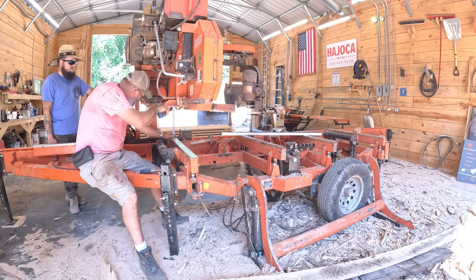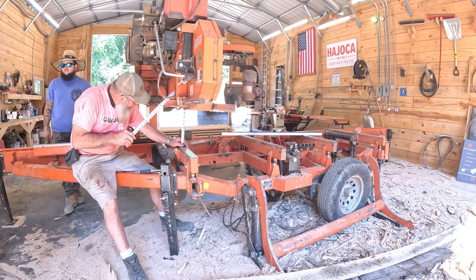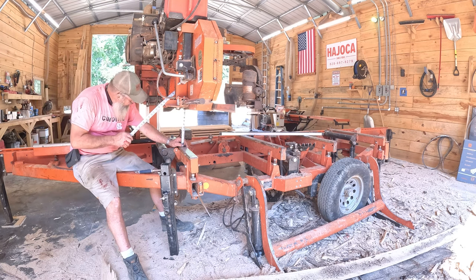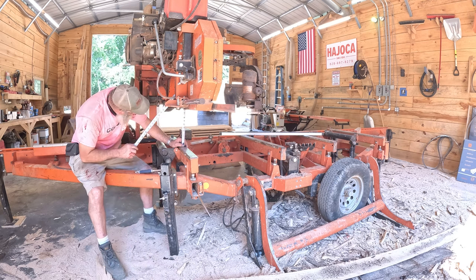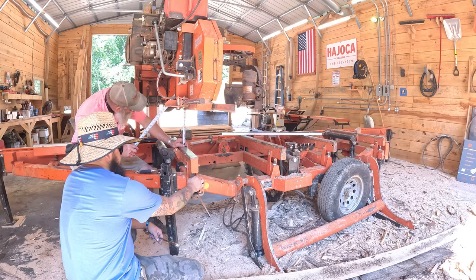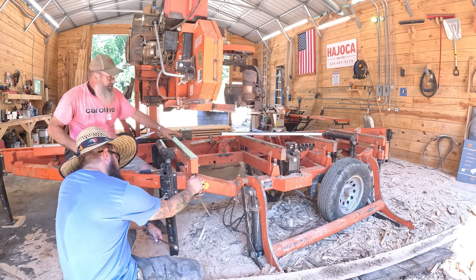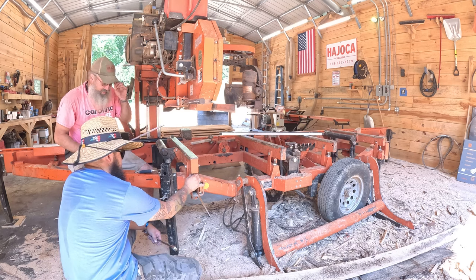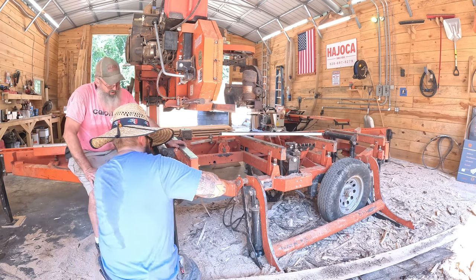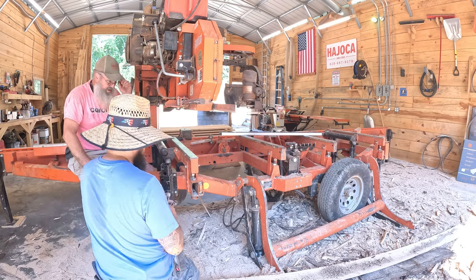Okay, right back to here, not up and down. Back to the water. Okay, we've adjusted that side to 12 and a 16th, which is right on the money. And this one actually needs to go up just a little bit. If you pull here and twist it, Matthew. It ain't a whole lot, just a little bit. Yeah, that way. Keep going. There you go. Now, we have all four bed frames in the same position. They're all parallel. Okay. I'll tighten them back down.